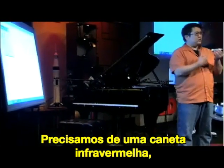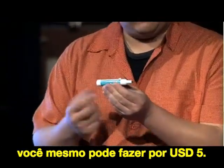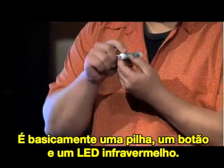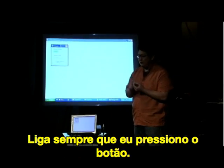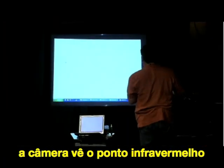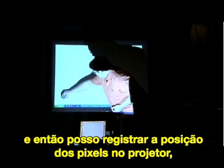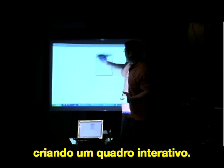This requires another piece of hardware, which is this infrared pen. You can probably make this yourself for about $5 with a quick trip to Radio Shack. It's essentially got a battery, a button, and an infrared LED that turns on whenever I push the button. What this means is that if I run this piece of software, the camera sees the infrared dot, and I can register the location of the camera pixels to the projector pixels — and now this is an interactive whiteboard surface.